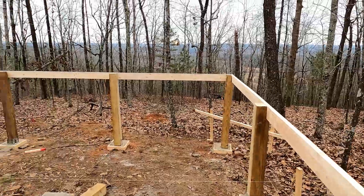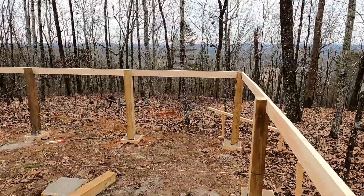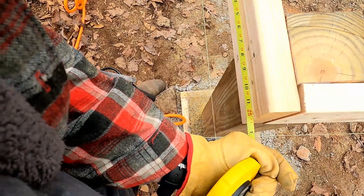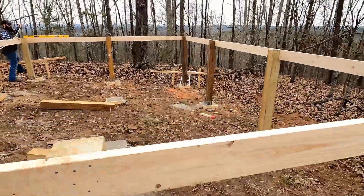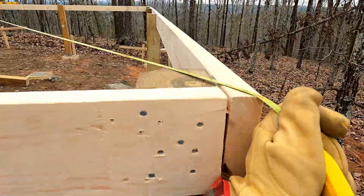Some reinforcements have arrived — my son Josh is here. Everything's done as far as the banding boards. Now we're just going to go around and make sure we're still square and everything is level. I checked it with the little level and the big level — some are off by an eighth or a quarter where one banding board is a little higher than the other, but I think we'll be able to make that flex with the subfloor. Josh, burn a foot — look at that, 25 feet and an eighth of an inch. So we're off by an eighth.